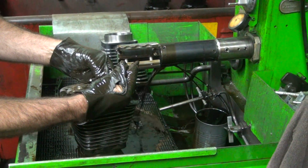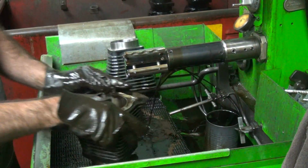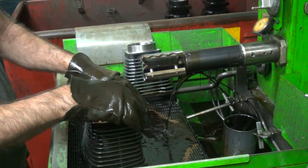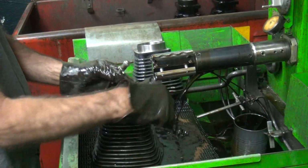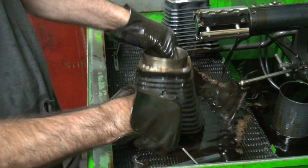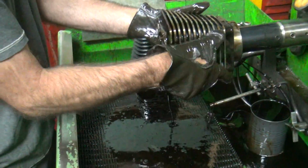Okay, I'm going to set this mag to what I want to cut. Right there. I'm going to force it through right there. Hard force there. That's good. There's a problem. So we're big down here and tight down there. So that means we're going to hone more there. That means we're going to concentrate on honing this right here at the bottom.